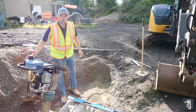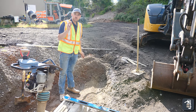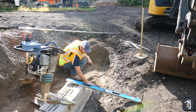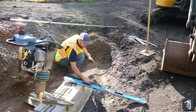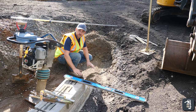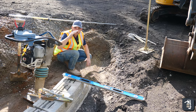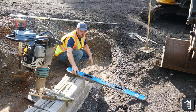A little bit of number nine stone — you can also use sand in an application like this. One of the big crucial parts when doing this is making sure that you do pad up your block with some stone or some sand, just that little bit. What happens is you put your first layers in, they settle down, and then you're going to do your second layer coming across here. If you don't put a little bit of sand there, this will settle down as well, and you'll end up with a little divot in your wall — you don't want to see that.